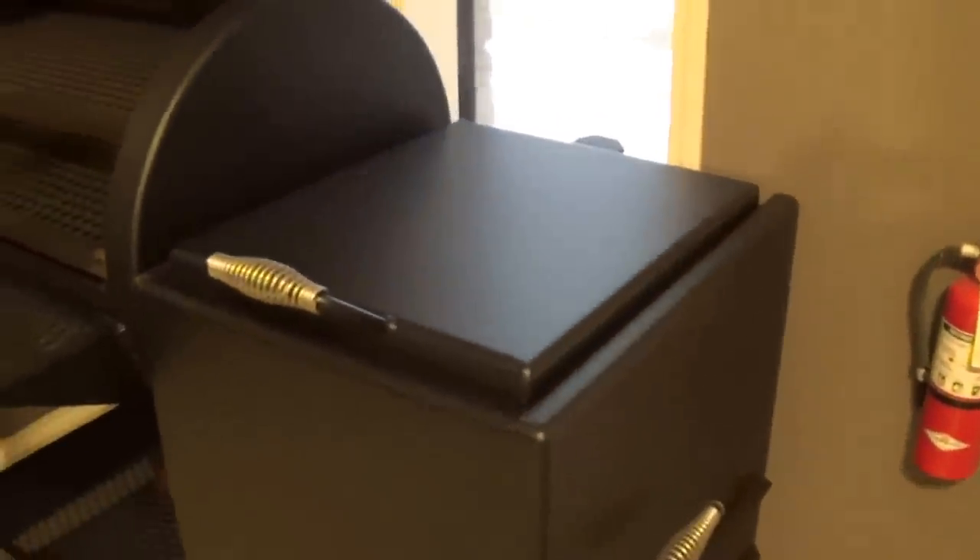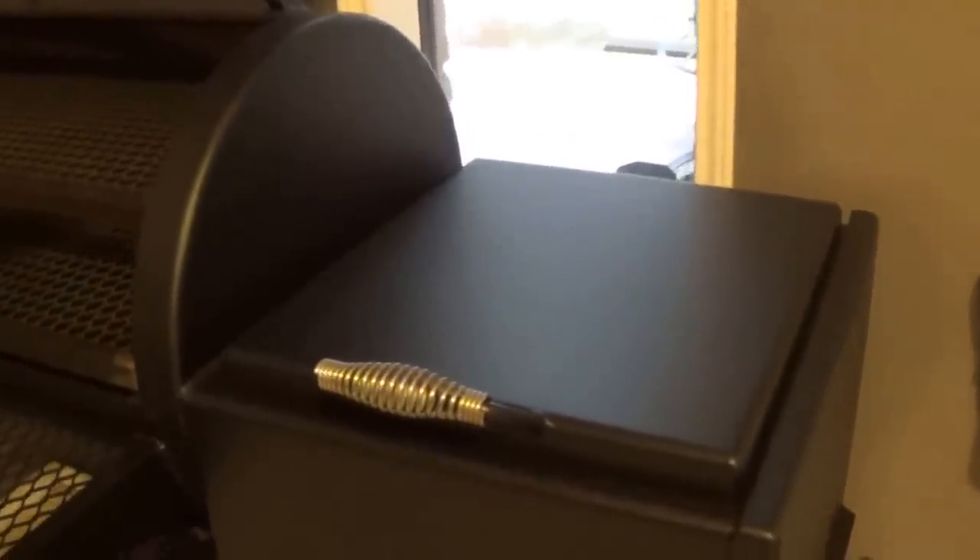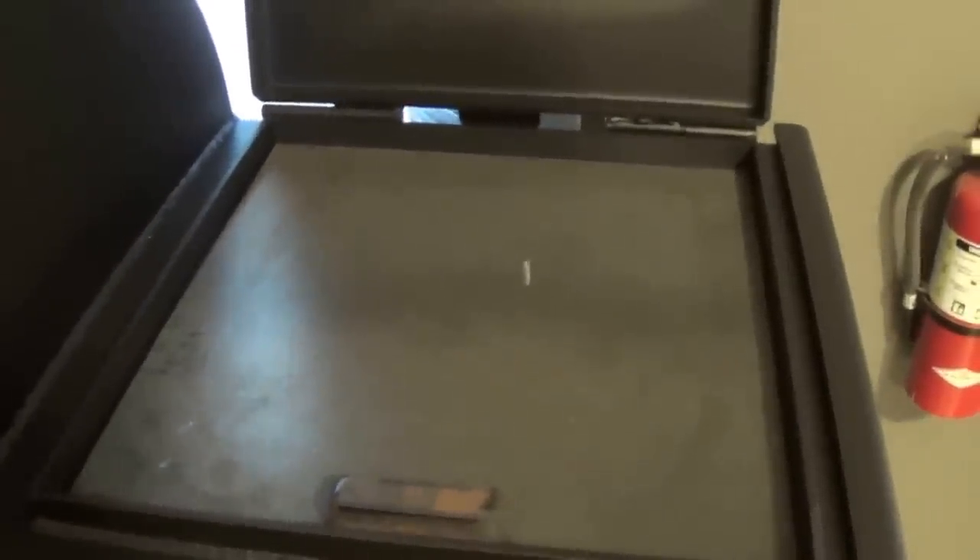As of June 1st, 2015, this is our new grill top lid design. We've slightly modified the lid on our firebox — they've always come with the grill and they still do, we've just updated the lid a little. Again, 304 stainless handles. This lid is flanged on all four sides and is one piece of steel — those sides are all bent, none of it has been welded, so there are no welds to fail or crack or break. Quarter inch steel — our firebox comes standard at quarter inch so all parts are quarter inch. We then have another flange on top of the firebox which reinforces the top of the lid and also prevents any water from going back into the firebox should the smoker sit outside during a downpour.